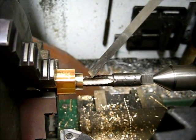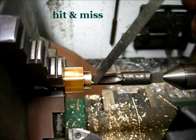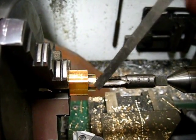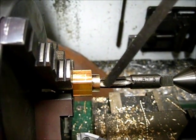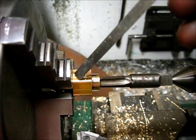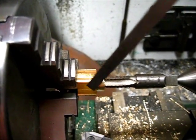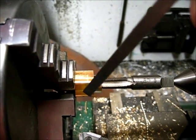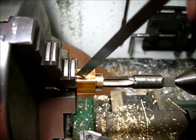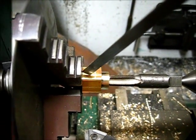The hole at number 7 - the pilot hole we drilled in there - I just kind of eye-sided that sideways, drilled down about that far, and I'll do some checking later. The drilled hole goes to about half of this hexagon, and then when I drill the one up from the bottom, it will probably drill into that one and make a pretty decent intersection. Then the number 7 channel down to the jet size will give ample flow.